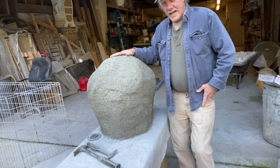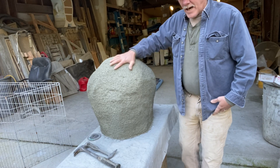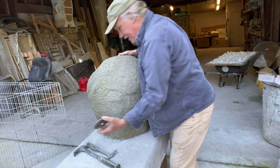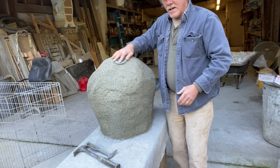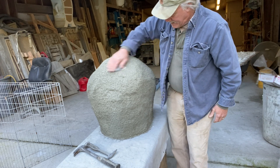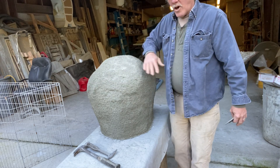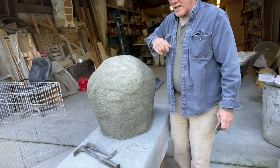The granite texture splatter that I did on this is dry — real rough. What I generally do is take a disc in my hand and lightly sand it all over, just like that. Then I clean it off, because you don't want that loose sand on there for the next step.